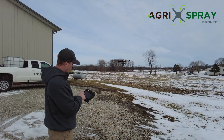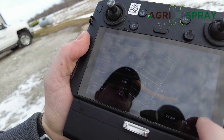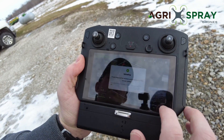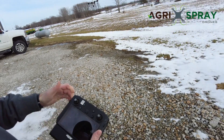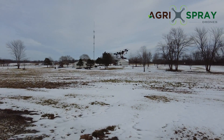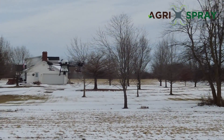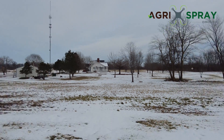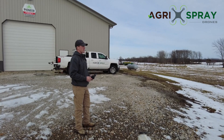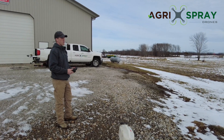Now all I have to do is load up product 1, replication 2. Since we already have product 1 in the tank and the drone's already out in the field, I pull it up, click invoke, click start, make sure my dosage is two gallons, speed all the way up, and just slide it again. The drone turns and faces the starting point for replication 2 and starts spraying. The old method of doing test plots like this is with a backpack sprayer and a Tyvek suit — those days are gone with a drone. It's safer, easier, more accurate, and way faster. The time it would take with a backpack sprayer is probably five times longer.